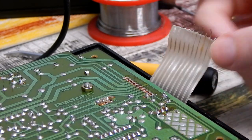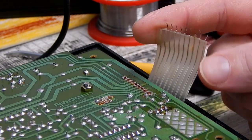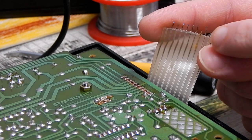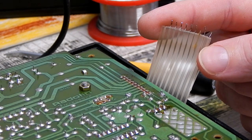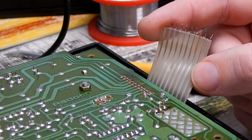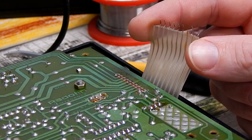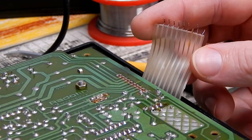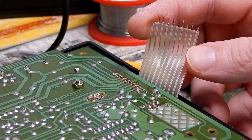On closer inspection of our ribbon cable, which I've now removed, you can see the connector on the end broke off. A third one is partly broken and another one actually came out of the board entirely. I have no idea how that happened other than me manhandling the board in and out. So this has become damaged — let's fix this and then test it again.